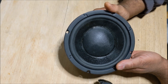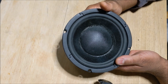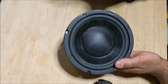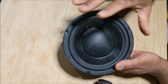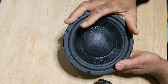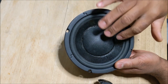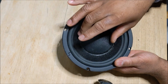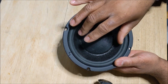So I did a white noise test using this driver, and the response was very unsurprising — I was right. There is a peak that starts at 2,000 Hz, and from 2,000 up to 3,000 Hz there's a huge peak which causes this driver to sound the way it does. The whole question is whether it's because of this larger dust cap. I don't really know if the original dust cap was removed and replaced with the 3-inch one, or if he just placed it over the original.